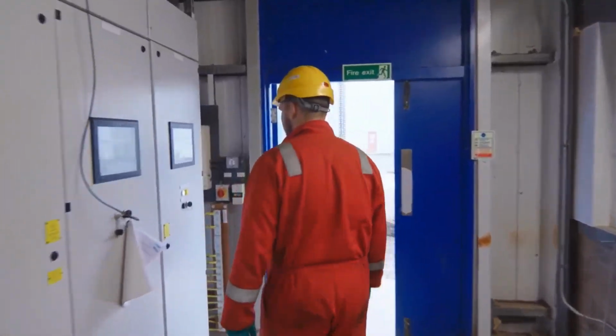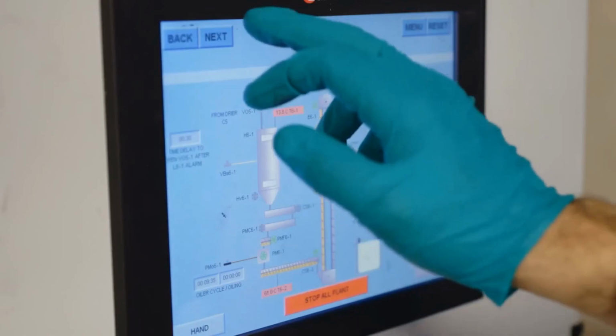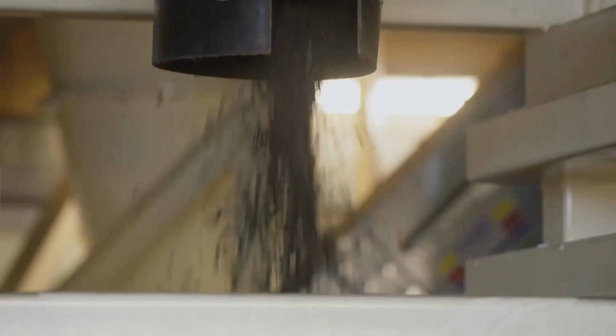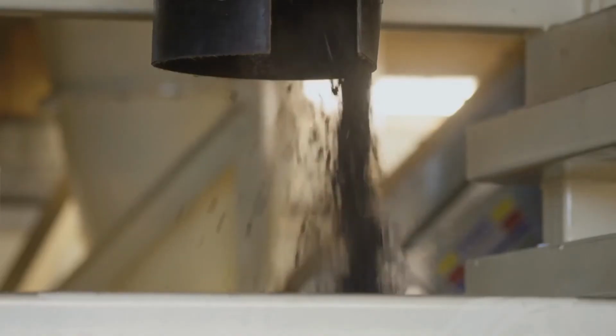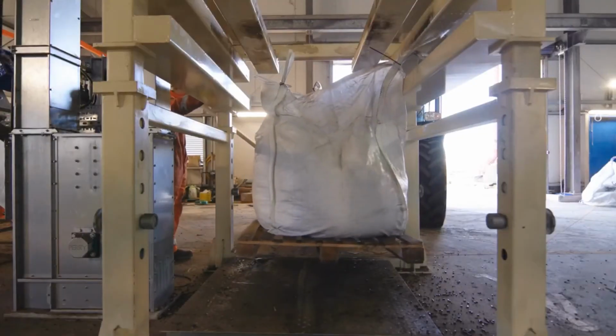The great thing about this CCM process is that it takes the treated sludge, it can take the ammonia that we need to treat, it can take the CO2 that we're emitting from our biogas operations, and we can access any spare heat that we've got to help with the drying of the process. So it's a really, really elegant fit with our wastewater treatment plant.